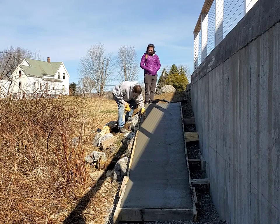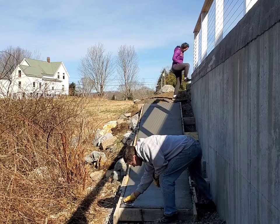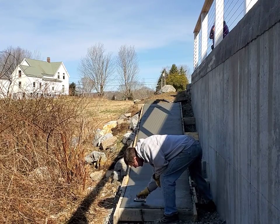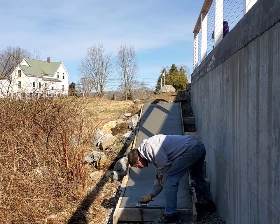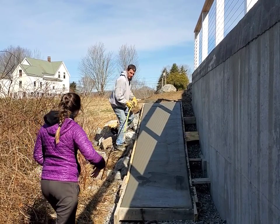So we're back — it's been about an hour and a half — and we're going to start finishing this thing. The first thing I'm doing is putting my edge on it. I've got a nice rounded edger and I'm getting all my edges cut in. I've got some other videos about doing edging if you want to check them out. This is always the first thing I do when I start finishing.